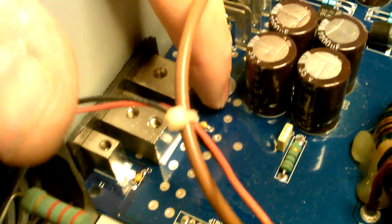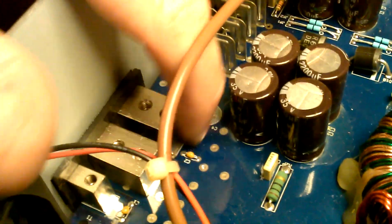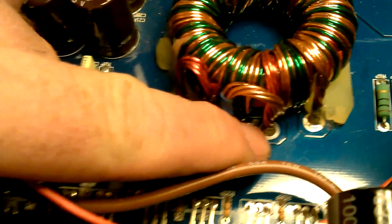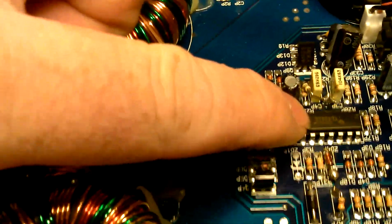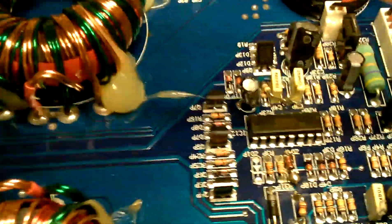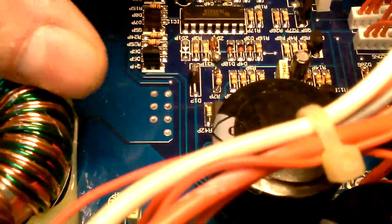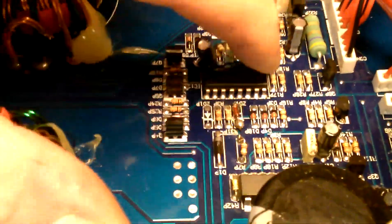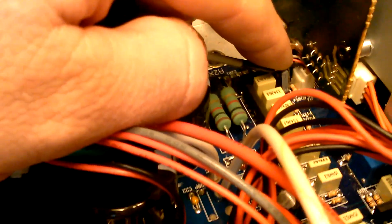Another issue is bolting components directly to the board with no solder — they just put them flat on there with really crappy connections. These always have to be re-bolted; I normally re-solder a bead all the way around them. On the back side of the toroid coils you have crappy solder connections again, not meeting where they need to be. These bad solder joints are just last-minute upgrades — instead of pulling the board and fixing it properly, they just slap it on top.